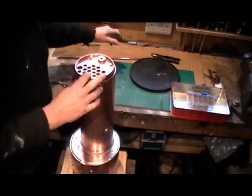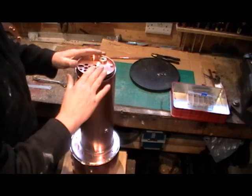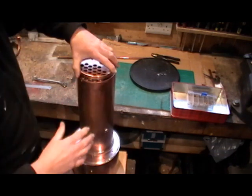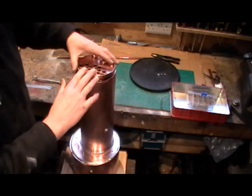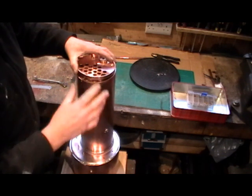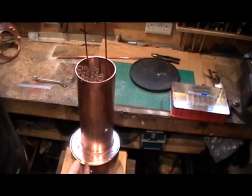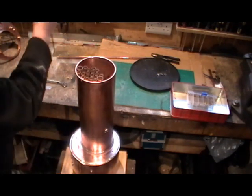I've put a dot mark at the top of the bush so I know the correct orientation. That adapter bolts onto the bush once it's all silver soldered in, and the steam tube comes up into the middle of it and is soldered in. I know this is all going to fit, but I'm not going to finalise it now because I'll have to take it apart again to flux everything. That completes my dry run.